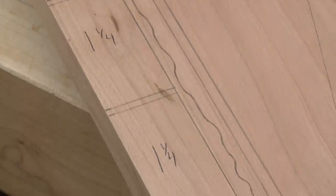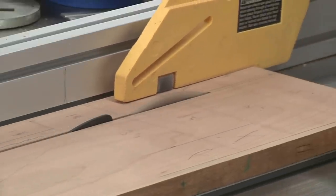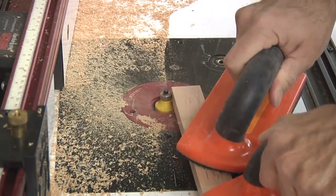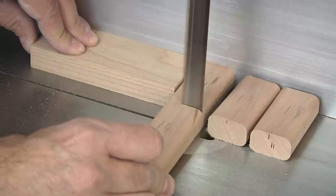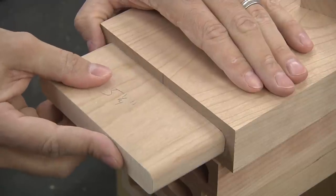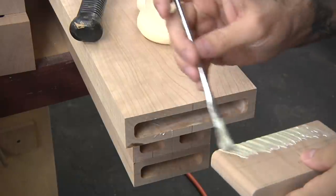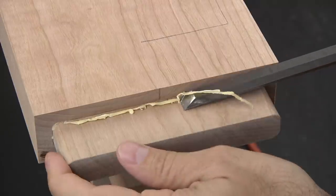So what about the tenons? Those will be cut from some cherry cut-offs. The great thing about this method is that the board is milled to perfect thickness, making all of our tenons the perfect thickness in just one shot. And with perfectly consistent mortises, we know that these tenons will fit like a glove. Because the mortises have rounded edges, we use a router bit to round the edges of the tenon stock. Notice I'm doing this routing before I cut the tenons to final length. And check out this fit — hard to get any better than that. To make life easier later, I glue the tenon stock into the rails ahead of time. Just be sure to remove the squeeze out once the glue firms up.